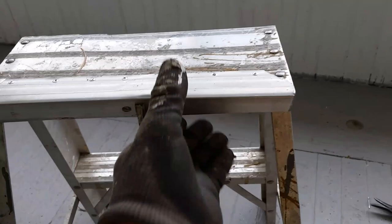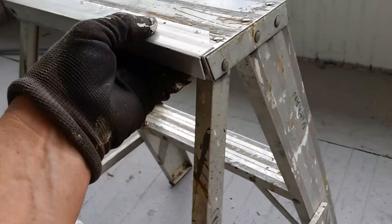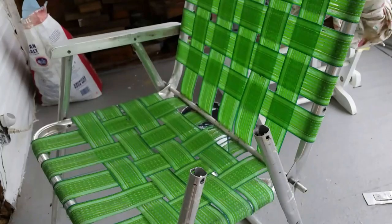You can see I got the corner here started, cut that off, got this piece here cut off. This is sort of a doubler. I had some aircraft aluminum but I just couldn't bend it at the right angle. This here was actually a 90 degree angle, but I just kind of pushed it in, took my hammer and tapped on it, made it even. We're gonna do the same thing on this side.